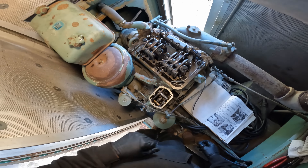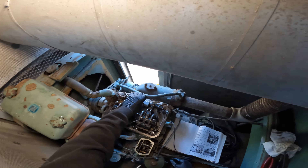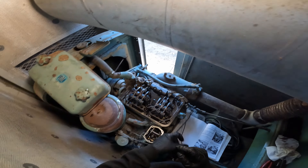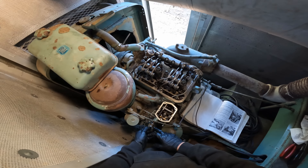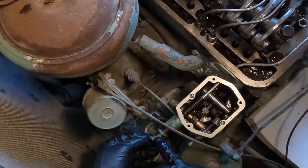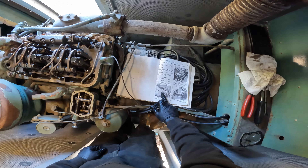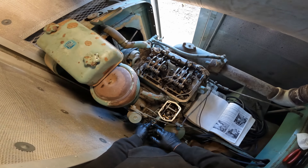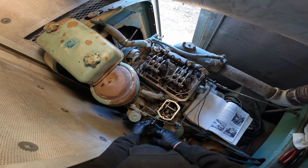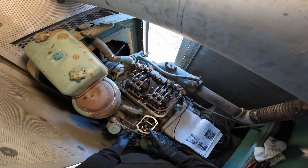Alright fellas, we jumped right in here. First step — by the book — move the governor cover, loosen all this. I didn't loosen this because I wanted to verify that my rack setting was indeed off, and it is — it's way off, I'll show you in a second. First thing you do: take this apart and remove this knob right here. Then there's a lock nut behind it. You want three-sixteenths of threads, which is 0.1875 inches. I used the micrometer — 0.1875 sticking out — then you put your nut back on, put your knob back on, and tighten the lock nut.